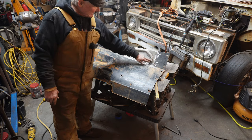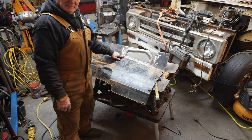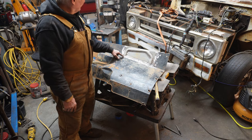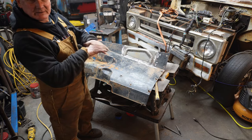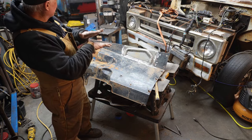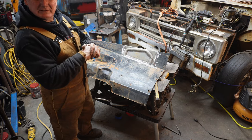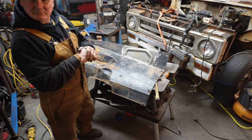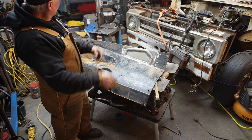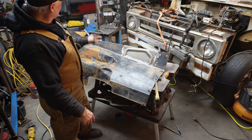I mean, in the end, it went ahead and beat this bead in, which I wouldn't expect it to do very well, and it didn't do very well. But I think down the road we can get some planishing hammers or planishing dies for it, and I am pretty sure I can get some shrinking dies to fit in there. That's what I'm kind of hoping for, so we could do some smaller shrinking and stretching panels on this thing.